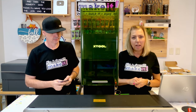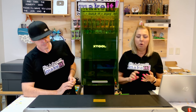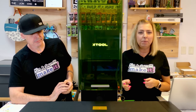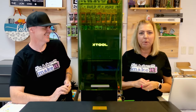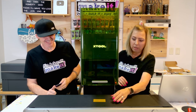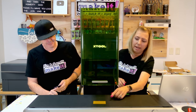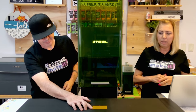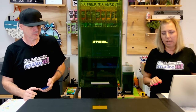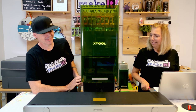If the light is shining on it, it's actually looking for that object with a tiny red light on it. And it makes it think it's got a hole in it or some sort of a round circle on it. So when you send the business cards through, if they don't happen to be lined up with that hole in the exact same spot, then it's not gonna recognize it. So my trick to you is when you scan with the conveyor, take it out from under the little red dot and have it scan right there. Either in front of it, behind it, beside it, doesn't really matter. Just don't have the red light on it when you're scanning it. If it will recognize that little dot, I'm thinking it's pretty precise on alignment there.